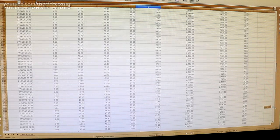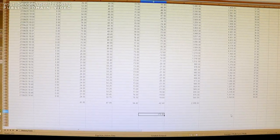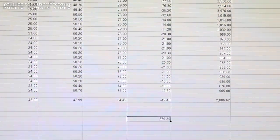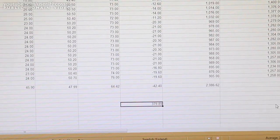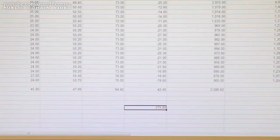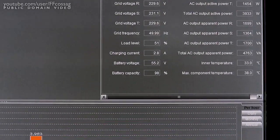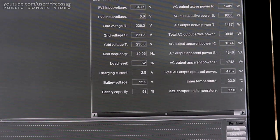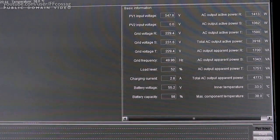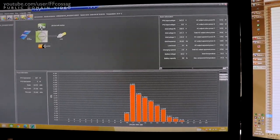The smallest load specified for these batteries is about 60 amps over a 10-hour period. I'm going to put a 2kW heater fan blowing outside - that gives us another 40 amps roughly - and maybe try to get up to 100 amps to speed the testing up. We'll do pack number two because it's been charging over the day and the batteries seem quite full. I reconnected battery number two and it's drawing basically no current even at the bulk charge stage, so that one's really fully charged. Battery one probably needs another day or so to fully charge before we do the next cycle. I'm going to rig up and do battery number two.